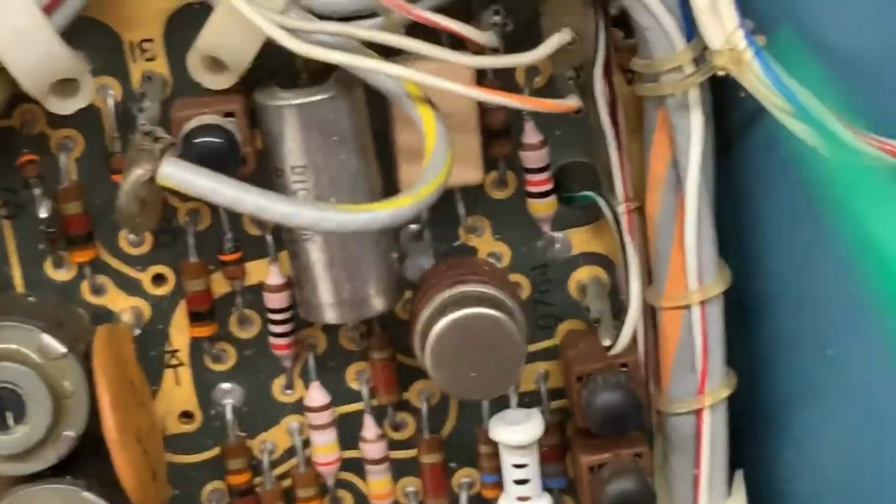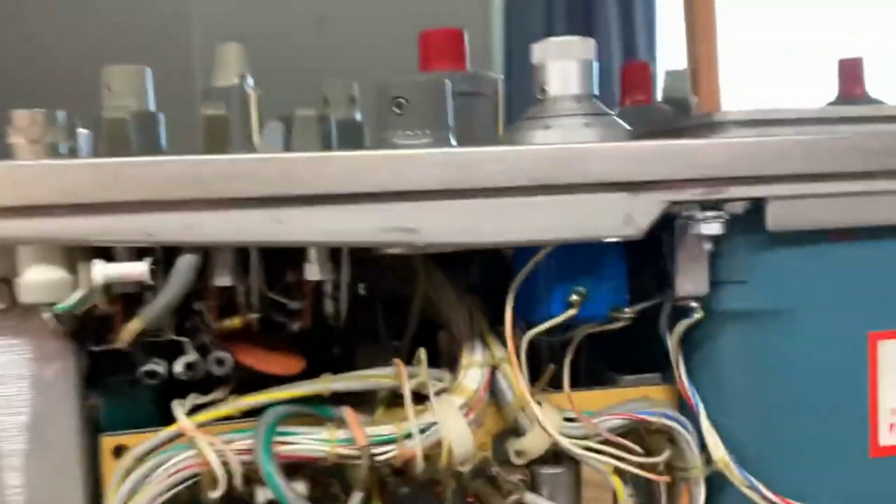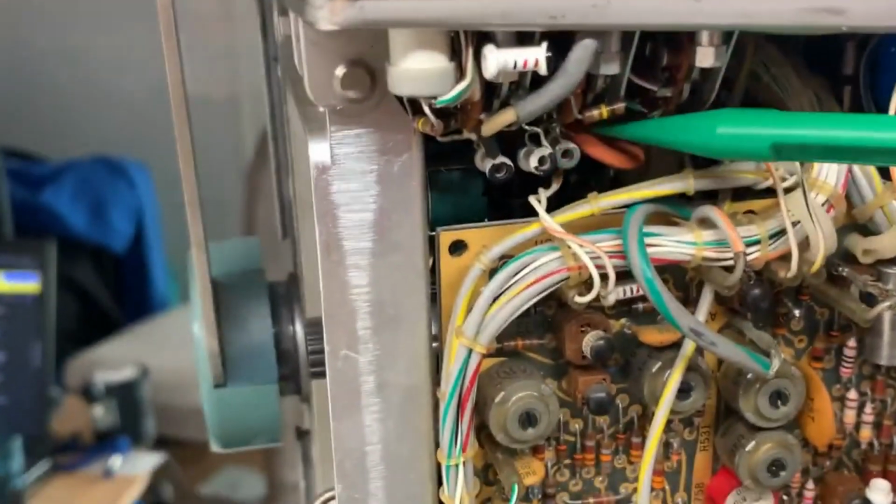Anyways, there is a twin diode, it looks like, and a single diode right down there. Let's have a look up into the control section right here. So here's your vernier. It's a Bohrens vernier, which means that it will probably be top of the line. Here are your switches. Let's have a look at those. Oh my god, that's mechanical switch porn right there. Check that out. That's neat. Some tubular capacitors across there, and a ceramic resistor, it looks like.